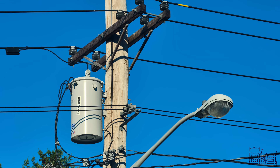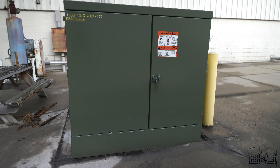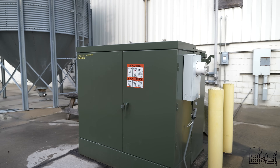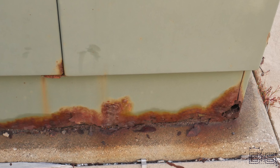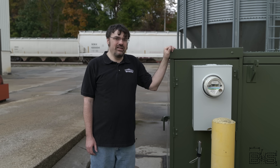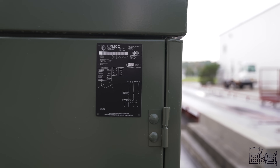The transformer to your house taps into one of these wires to give you single-phase power. But for us we have three-phase, so we need three wires, and those three wires run underground over to our pad-mount transformer. This is a brand new transformer — the old one had to be replaced because it was rusted out and leaking oil. These transformers are filled with mineral oil to conduct heat out of the core. This transformer takes 12,470 volts from the power lines and steps it down to 480 volts, which is a common voltage for a building of this size. Because the transformer is in a star or Y configuration, we can get 277 volts from phase to ground.